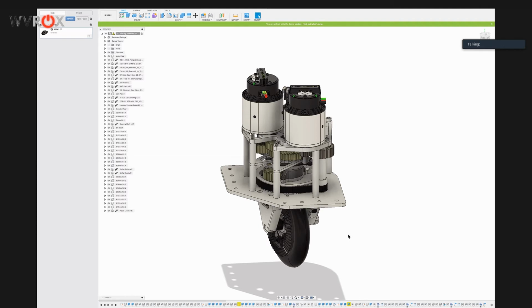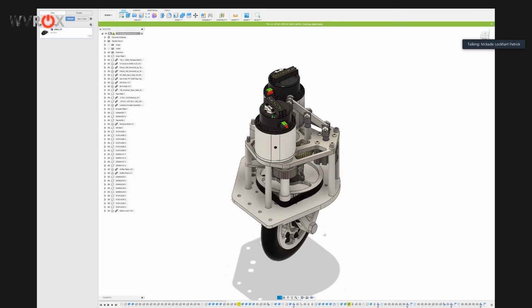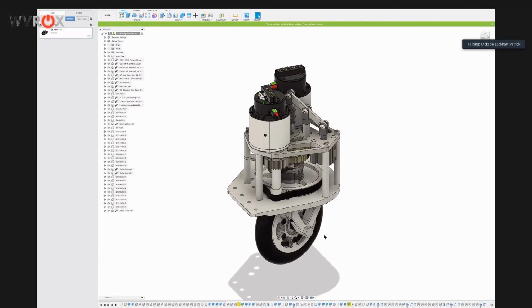So why shifting? I've been trying to convince myself that shifting is worth it, just because with the Falcons and brushless motors, there's a lot of question as to whether shifting is really viable, or at least useful. Personally, the main reason I think this is helpful is being able to accelerate faster and being comfortable with gearing super high and not browning out whenever you hit something at those super high gearings. Those are the advantages of shifting.